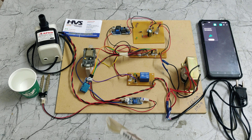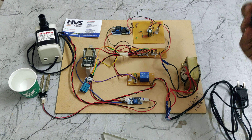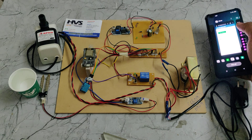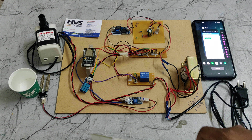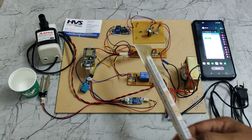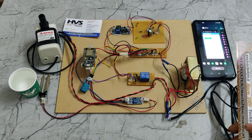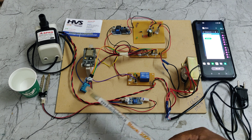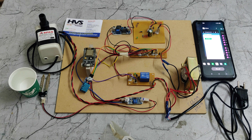These three values are continuously monitored through the Blynk IoT application, as well as through ThingSpeak. ThingSpeak stores the data until you erase it, presenting it graphically, and you can download it as an Excel sheet. The two sensors interface to the NodeMCU at pin D0 for the relay to control the motor, the humidity sensor at pin D3, and the soil moisture sensor at pin A0.